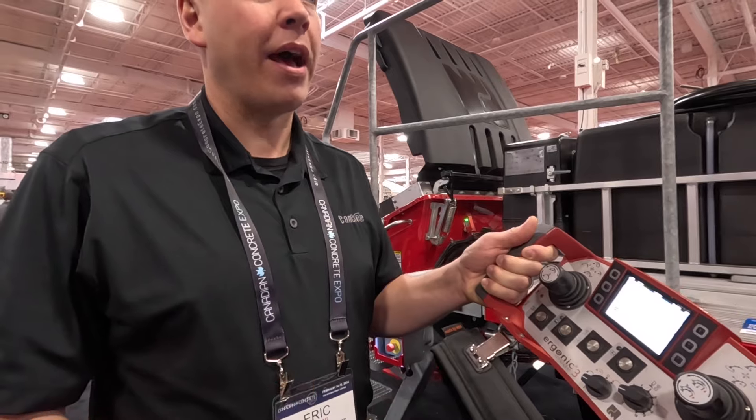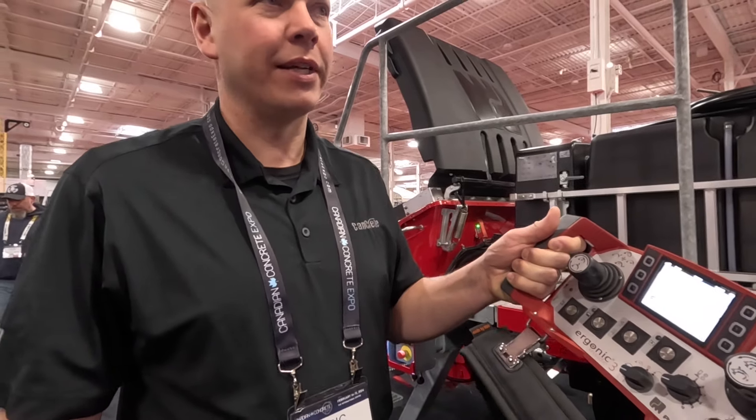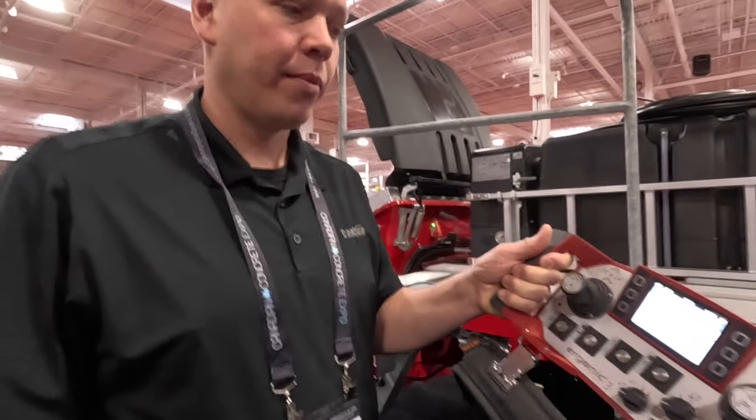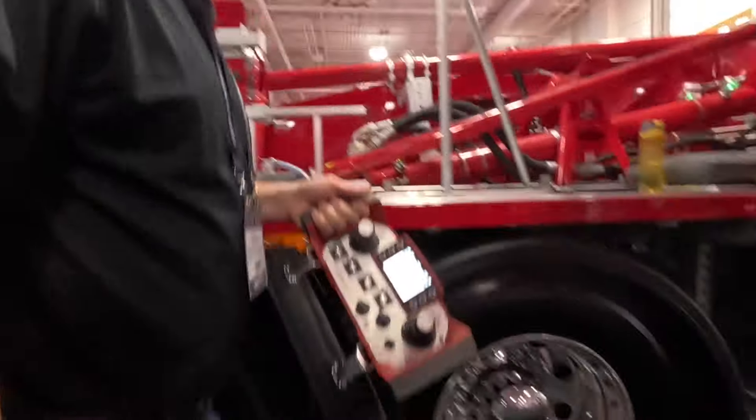In a cold climate like an Alberta winter at minus 25, if you leave your truck in outrigger mode it sends oil over the relief valve of the outrigger circuit. Our oil volumes are about half of what a 2012 model year pump had, so realistically 10 to 15 minutes and you should be okay. Leaving it in outrigger mode is the trick to building some heat.